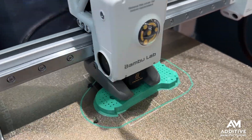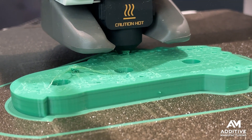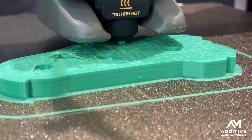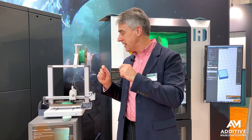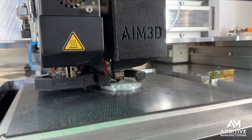Voxel fill is a patented technique. AIM3D applies it on its own 3D printers, but it can be applied to other companies' 3D printers as well. Every FFF 3D printer is ready to be an injection molding machine, sort of, because the injection step just requires the extruder to move over that open space and deliver melted material into that opening. No special hardware adaptation is needed except a nozzle thin enough to reach into that small opening.